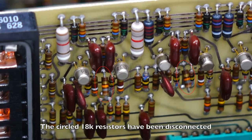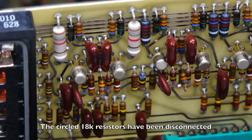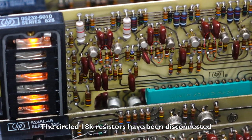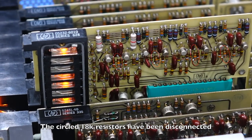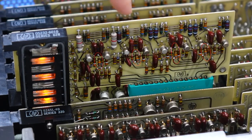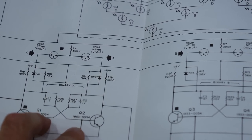I can point to them, and those are all the resistors tied to the reset. So I thought I was losing my marbles, that the transistors and the diodes were good and this wouldn't do anything. And then I noticed by probing around that the base of each transistor that wasn't flipping was tied to something, and it shouldn't be. And even on the one that worked, it wasn't symmetric.